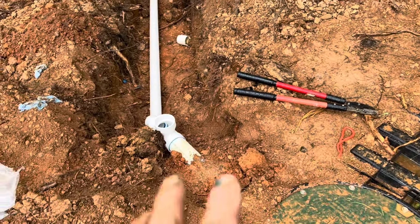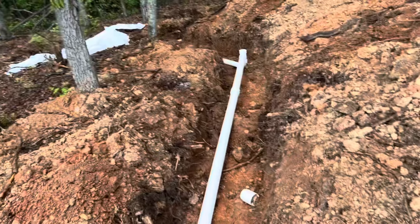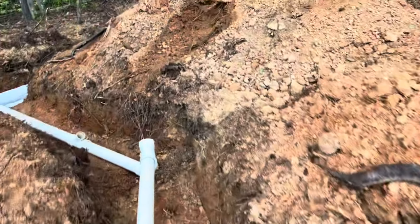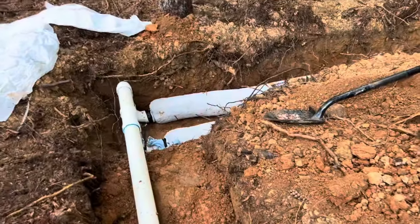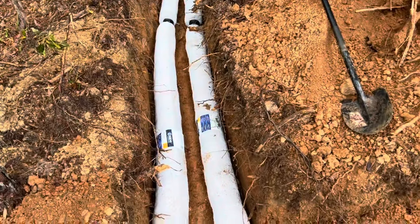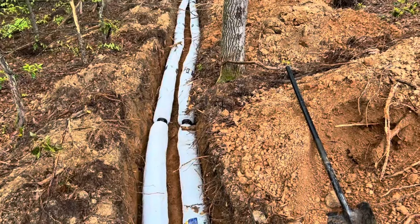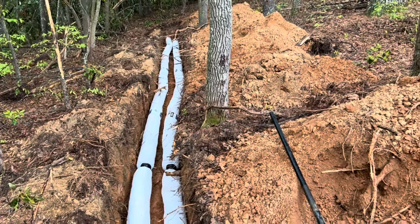It should never get clogged because the only thing coming out of this end of the septic tank is the effluent, which is nothing but water, going into the drain field. All the solids are trapped in the tank — it's a two-compartment tank. It comes down to this one, then down to here, and this is where we used some pre-made drain tile pipes with peanuts on it. It's starting to pour down rain, so we got this run in here and we'll get the other run in when it stops raining. We'll go ahead and backfill this, but I wanted to shoot a little bit of the septic tank drain field before we started covering it up.